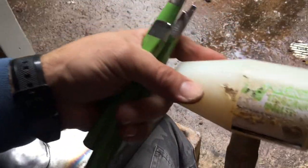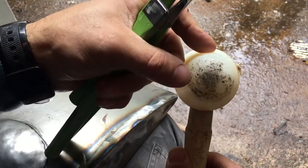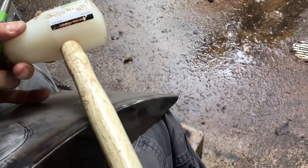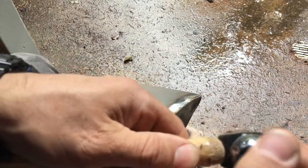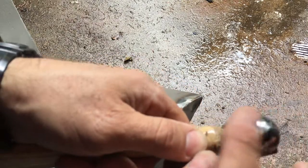This is also a Harbor Freight teardrop mallet. It has a small dome and a large dome, and then every now and then I go back over — once it gets chewed up — I just sand that down smooth and get that profile the way I want it. The other tool I use is a small ball peen, just an inexpensive one that I took over the polishing wheel and cleaned up so it doesn't leave scratches in it, but it does leave the dents that I want.